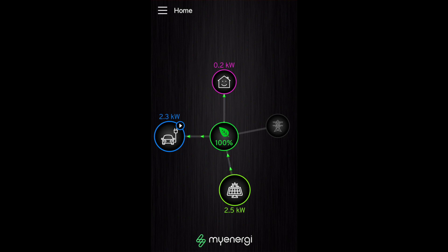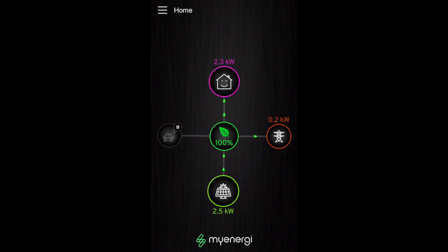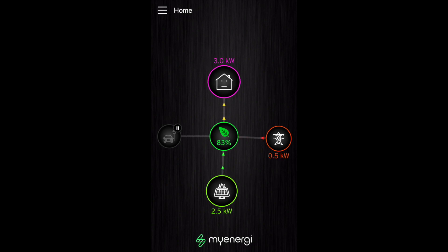And there you go - you can see now the app is registering generation from the solar and consumption by the house. This is great because now we can see what's actually happening: how much the house is using, how much we're generating, and how much we're exporting. Whereas before we could only see what was either being consumed by the house or exported from the house, but we couldn't see how much energy was actually being generated by the solar when the house was consuming electricity. With only one sensor in place you can't delineate between the two things, so that's why you need the two sensors and that's what makes them so useful with the app - it gives you a lot more information. Anyway, I hope that was useful, thanks for watching, and we'll put the Eddy in in the next one.